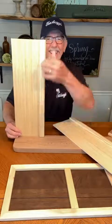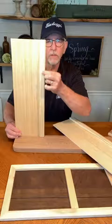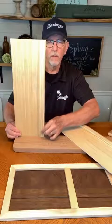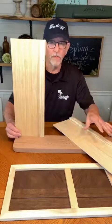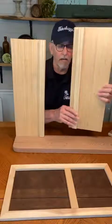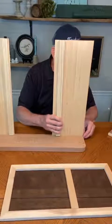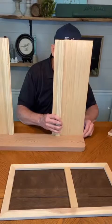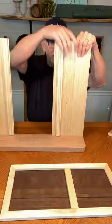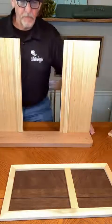This is the door facing. You'll know the left side because right here I have pre-drilled the holes for the hinges that go with the screen door kit. So obviously this would be the right side. Take it and do the same thing — align it with the very edge here and give it a little bump down into the groove. It should fit fairly snug.